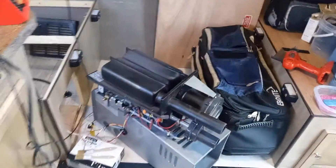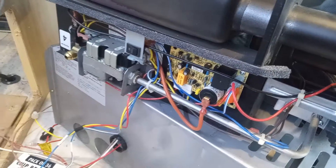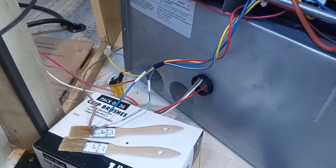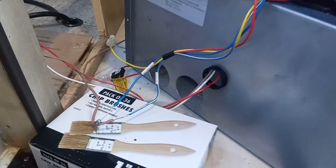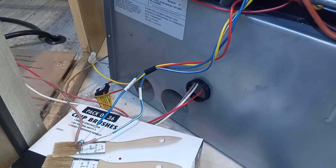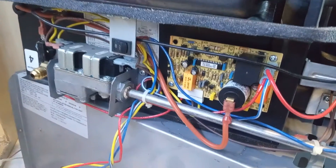With the forced-off open connection, it will turn off in about 20 seconds. So yeah, it's not the board. It's not turning on. I was measuring and I thought the voltage was good coming from the thermostat — I had been measuring each of those two wires individually — but jumping them together for sure lets you know it's not the thermostat.